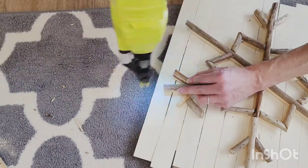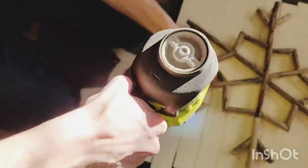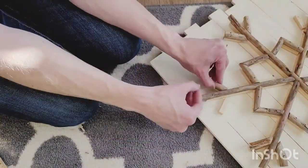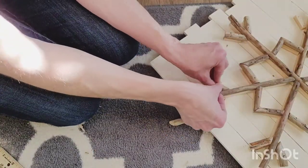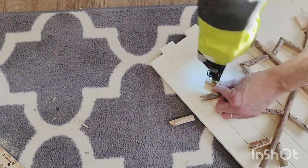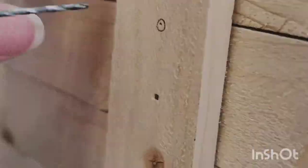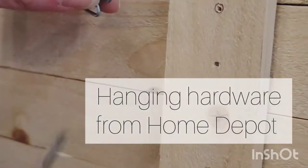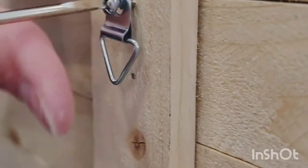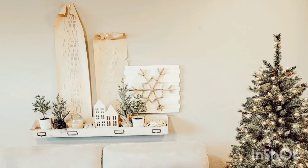After you get all your pieces on, blow off any little bits and pieces and check your ends — does anything need to be sanded or cleaned up? I also made the mistake of not sanding off the green colored tip of my dowel, so make sure you don't use ends with the dye color from the store — just cut those off. When you're all done, raise up your piece, pre-drill the hardware hole, and screw in your picture hangers. Measure, mark, pre-drill, screw it in and you're good to go.